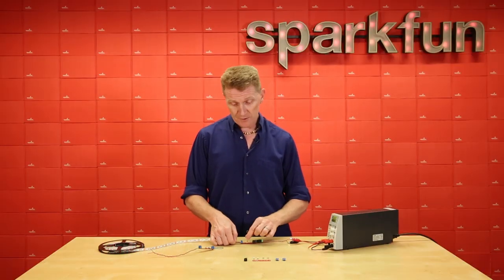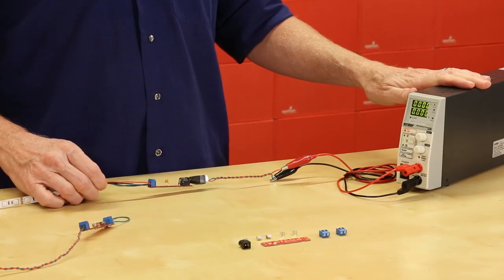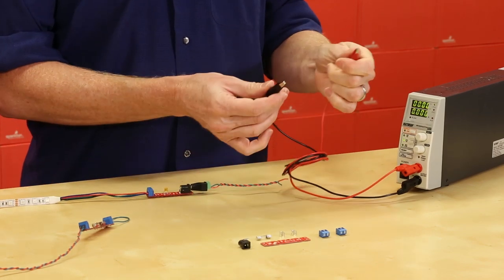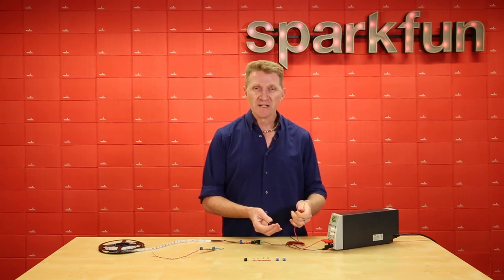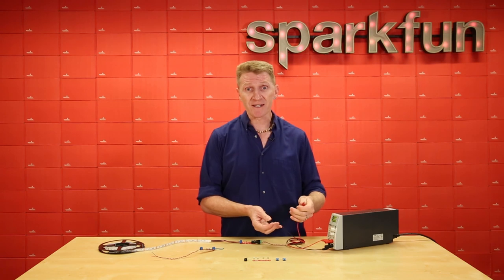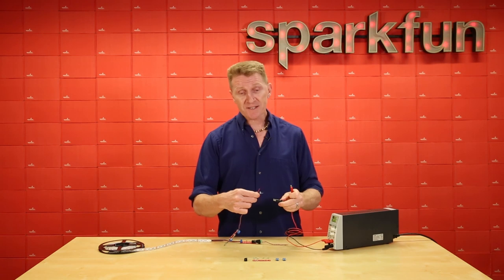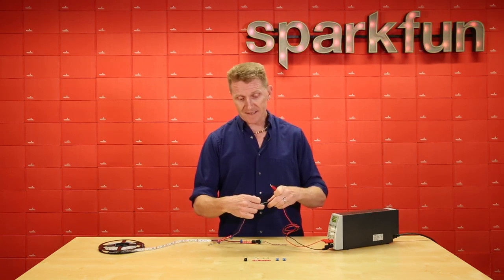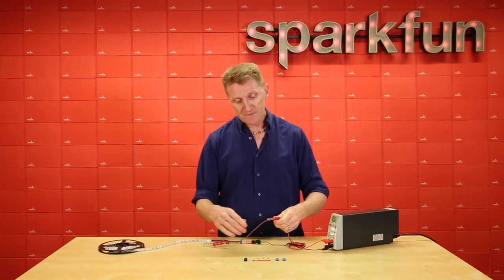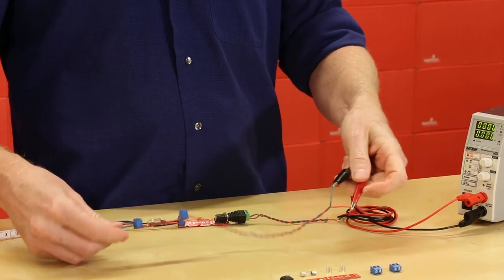Now, this is going to get hot, so be careful touching it. Ow. I've got a nice power supply here, but what would happen if I took these two alligator clips and connected them together? I think you know. And that's what can potentially happen if you have a short circuit or a ground fault in your circuit, and that can wreak havoc on your project. But a fuse is designed to circumvent that — it will sacrifice itself to save your more expensive components. So what I've done here is I've hooked these two together, but I've put a fuse in the middle of it.